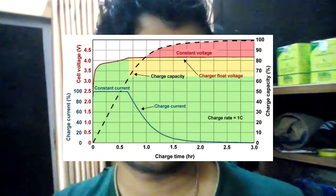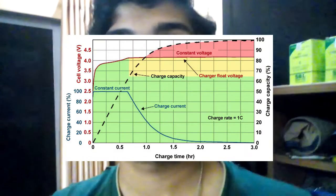In my case it is safe — my battery supports up to 1.1 amps and my charger provides 600 milliamps. After the constant current phase, your battery voltage reaches 4.1 to 4.2 volts, and then it begins to charge in constant voltage. When your current starts to drop and your voltage starts to rise, that's the mode we call trickle or constant voltage charging, and then it's done.